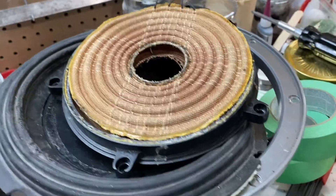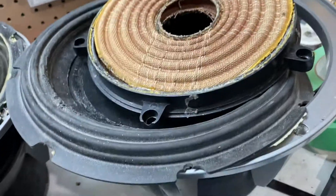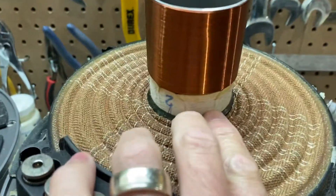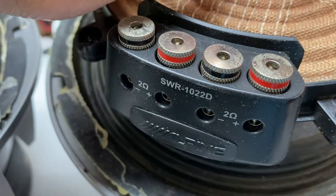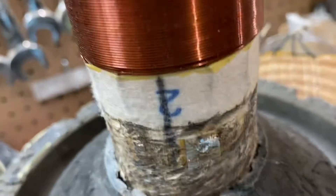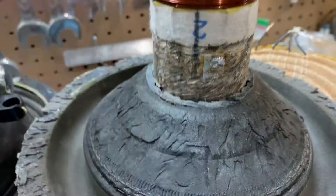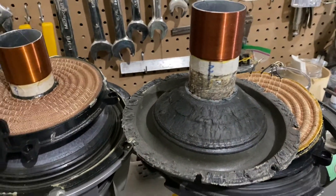That's another thing I've seen a lot of on Type Rs. If your spider is snug against the voice coil former, it probably isn't the case and it could be a coil issue. I would check your coil at these locations on either side of the two or four that will be printed on them. You don't want to damage your pigtails at all, so I wouldn't sand away at these to expose copper. But if you expose a little bit of the nickel strip where the lead connects right beside it, you're not going to cause any issues and you can read off of that. You don't have to cover it back up — it's nickel, it won't corrode ever. That would be the easiest place to do it where the nickel strip starts.